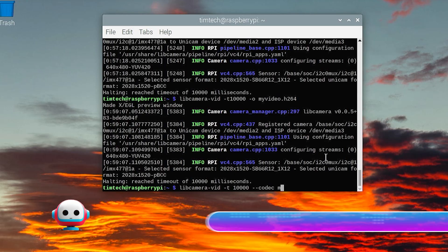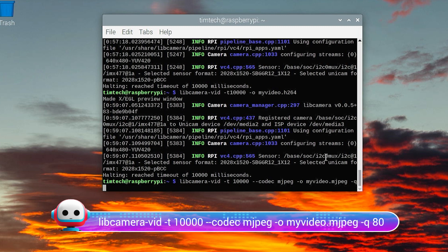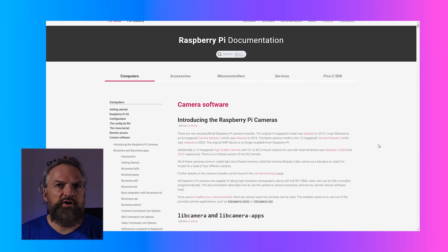There are some useful options to set our video properly. When using the Motion JPEG codec only, we can set the quality to a maximum of 100, where 50 is the default value, like: 'libcamera-vid -t 10000 --codec mjpeg -o myvideo.mjpeg -q 80'. We can also set the target bitrate in bits per second when using the H.264 encoder — for example setting '-b 10000000' for a 10 Mbps bitrate. You can explore all possible options and configurations by following the official Raspberry Pi links in the description.